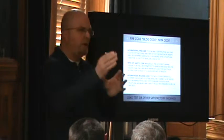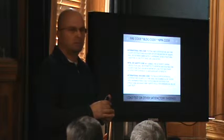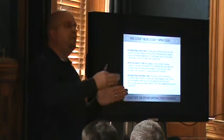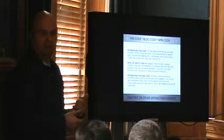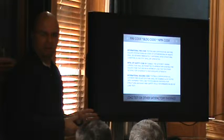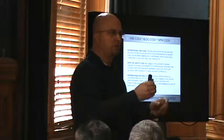An engineer is going to go out of its way to provide you other evidence of strength, which is a refurbishment of a fire escape. A fire escape built within its first 25 years — do you think you need to change the bolts? Between 25 and 50 years, do you think a bolt change is coming? Because in that building in 50 years, have they changed the windows, the roof, the boiler, the bathrooms? Have they changed the fire escape? No. The average lifespan of a bolt is 25 to 50 years — swap out the bolts, keep the steel.